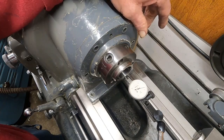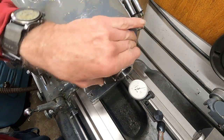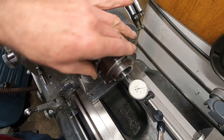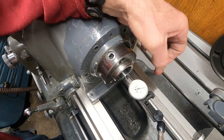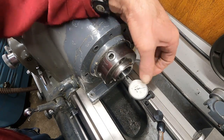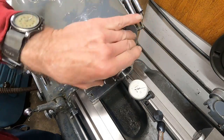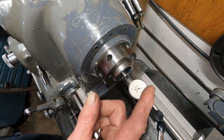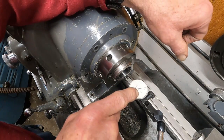Let's get the needle in a different spot. It went right on a number. How much runout do you think that is? Each little space is a hundred millionths of an inch. We put this test indicator on the face, on the taper, and it reads the same.